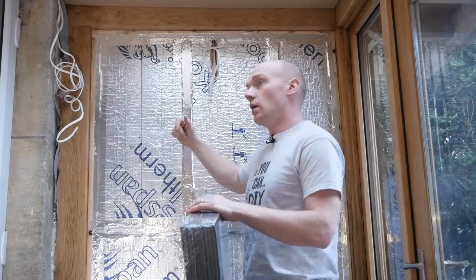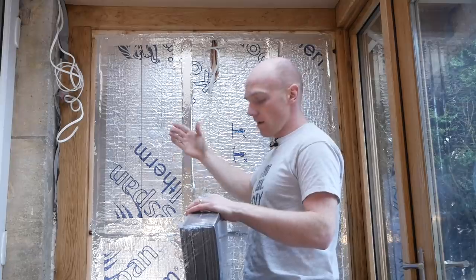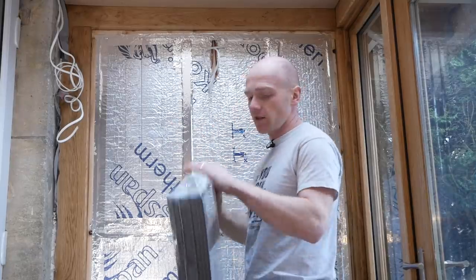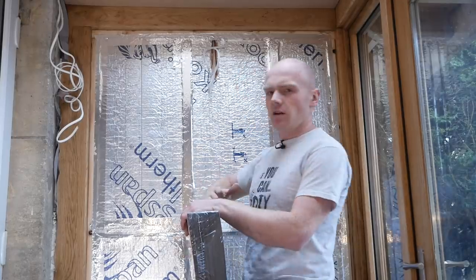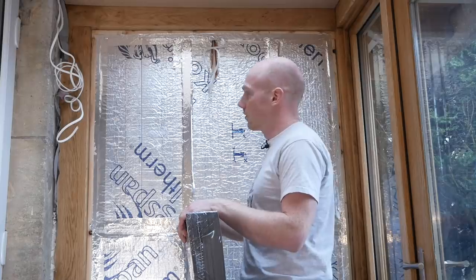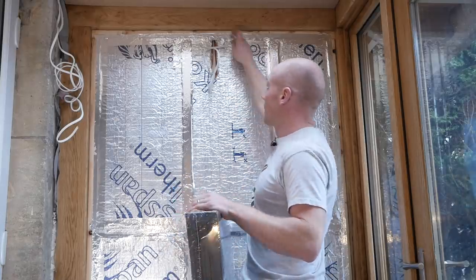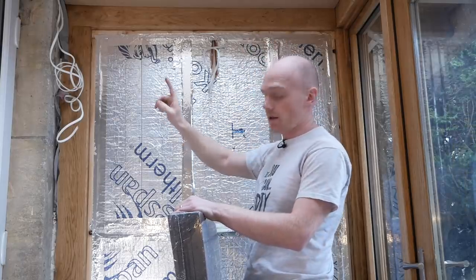But even more, we've got, you know, the road outside between the MDF and this. I think this should work pretty well to deaden it. I mean, this is an acoustic type underlay as well. So we're just kind of underlaying onto the wall, if that makes sense. Plus it's black, which means our shadow gap around the outside of our panel will remain black.